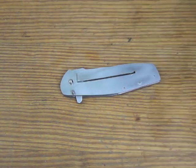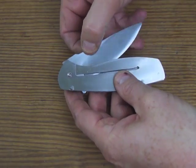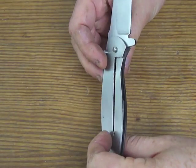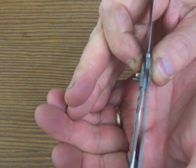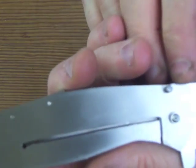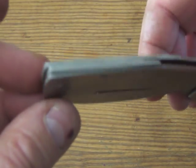I did a little bit of grinding there on the angle of the bevel. Let's see if it works — if we hear a wonderful click and this knife actually locks. Oh yeah, the sound of a liner lock locking! You can see I just barely have it locking up right now. That's because I'm going to fit this a lot more when I have the scales ready to put on, so that I don't overdo it on the lock up. That's just real easy to do, and then it's back to making another liner or another blade. So this is turning out really well.